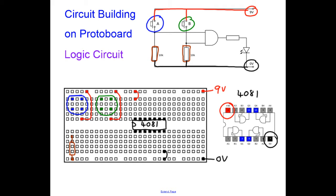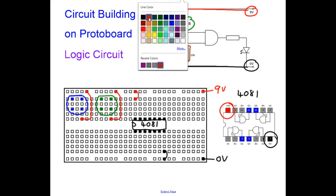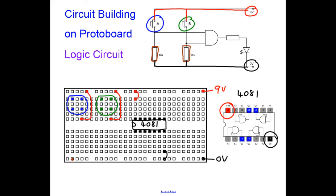My resistor connects from the 0V, crossing the gap between the 0V and the set of five. Make sure your resistors don't take up too much space — it has to go up and leave enough space for two more connections above it. Notice when we draw protoboards we draw the components as they look. Now take a piece of blue wire because it's a blue switch — use colour coding — and connect the switch to the resistor, then connect the switch to the input of the logic gate. I'm going to use the first logic gate; the first input is pin 1, so I take a wire from here all the way across to pin 1.